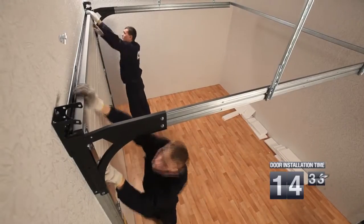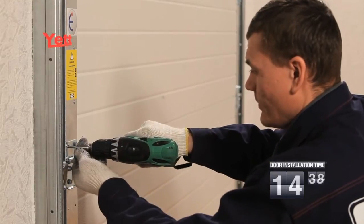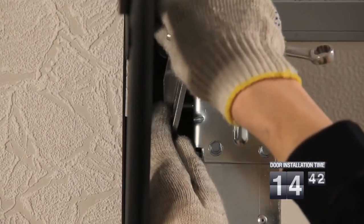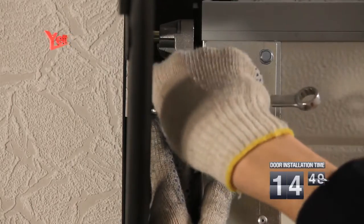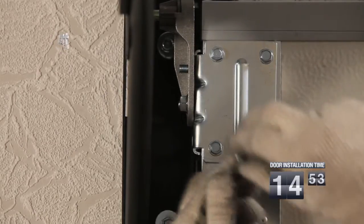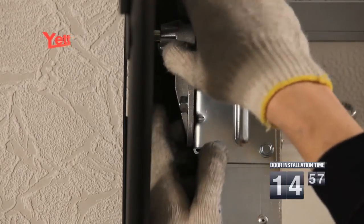After the installation of the second and the subsequent sandwich panels, it is necessary to fasten the panels together with the help of self-tapping screws. A separate roller cage with a roller is for the top panel. This roller cage allows regulating the clamp of the sandwich panel to the top sealant. Also, a manual or automatic adjustment of a roller is made with the help of the top roller cage.